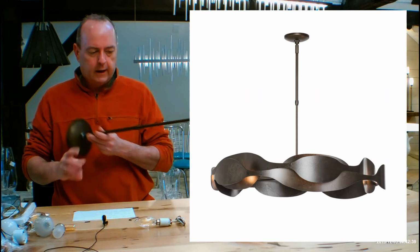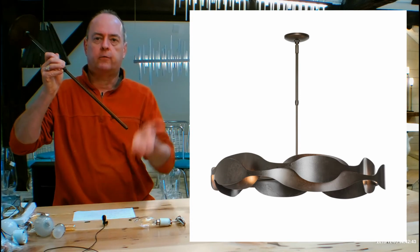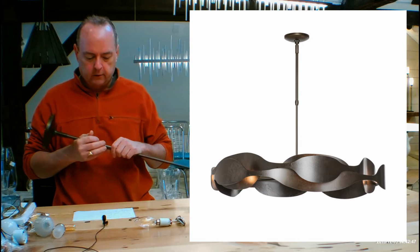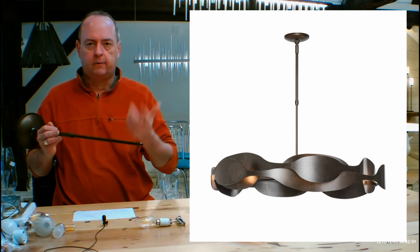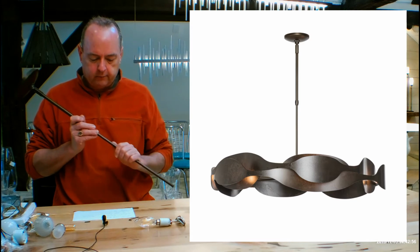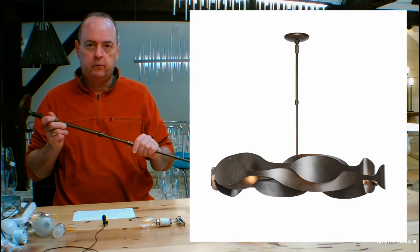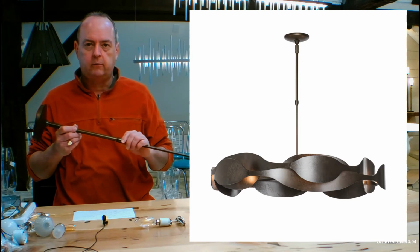Okay, when we add the fixture body to the telescoping rods, you're going to have overall height ranges to play with, and you'll see there's a pull down menu that will show you what those are, and we measure those from the bottom of the fixture to the ceiling itself. Remember, we don't talk about parts, it's always the whole thing. So the short is going to be 27 to 35.2. Standard is 35.2 to 42.2, and the long is going to be 41.8 to 49.2.